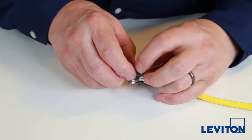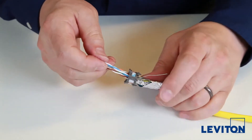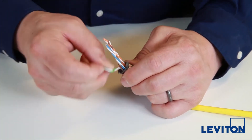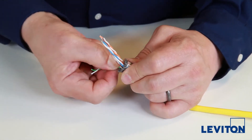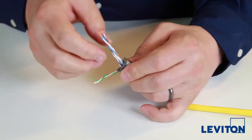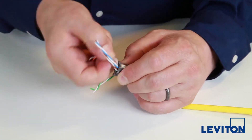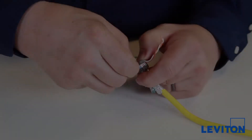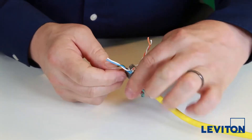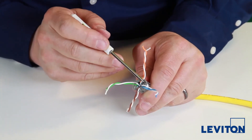Line the wire manager with the corresponding colored pair and snap it shut. Seat each pair into its wiring slot, untwisting the pair to ensure the center element is completely visible. There shouldn't be any pair crossovers at that point. Do a quick polarity check to make sure the white wire of each pair is closest to the guide pinhole.